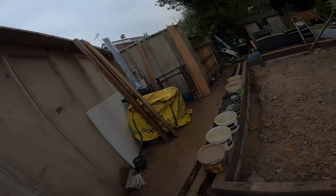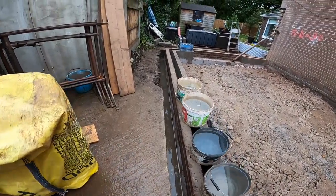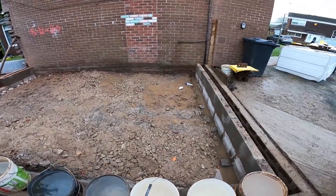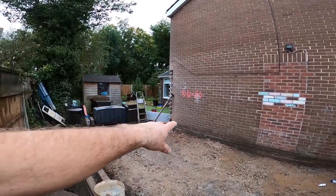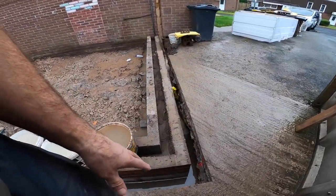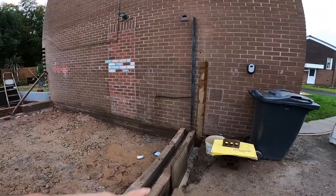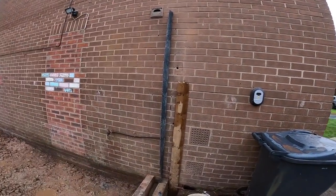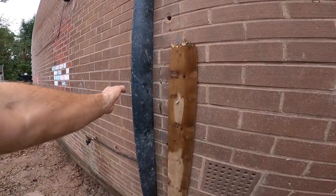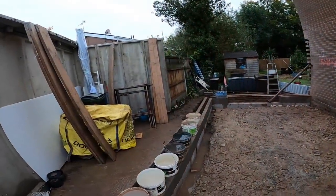So yeah. Just filled the buckets up, the rain's filled the trench up, stone's coming tomorrow, don't know what time, toothing's done, brickwork's all up to DPC, profile holes are cut out ready for the profiles, buttons up ready for the brickwork, and DPC is in, vertical DPC, that's 150 damp, that's why it's sticking out so far. Yeah, that's us for today.